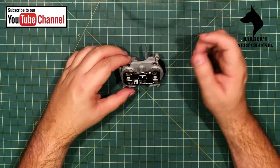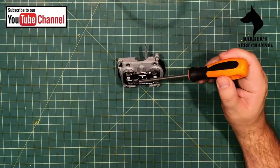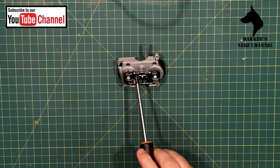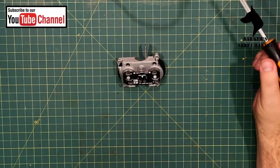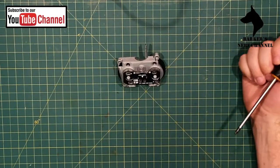All right. So basically, we're going to solder it there and there, there and there, just the terminals, and then the wiring is going to come in at these locations, the positive and the negative there on the board. So what that means is that there is no tension from the wires directly on the terminals, which is pretty cool.